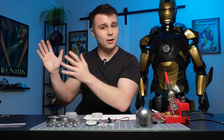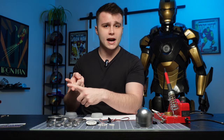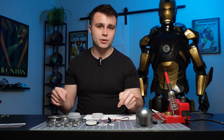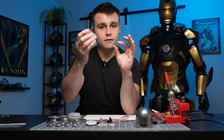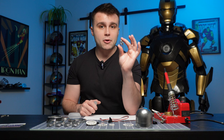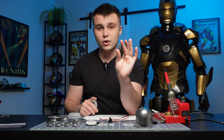I came up with a pretty ingenious idea — I took XL97's Iron Man helmet code and just sprinkled in a little bit of NeoPixel stuff, and voila, you have code which allows you to turn on and off a set of NeoPixels with a button. Most of that code is basically useless since we're not using servos or ILEDs, but it still works. The code will be in the description below. We're going to be uploading that code to a board of our choice — I recommend going with something like the ATtiny85 board we used in the previous helmet motorization video, because this is actually going to fit inside the casing of our arc reactor. Arduino Nanos are going to be slightly too big.